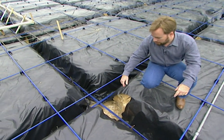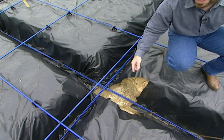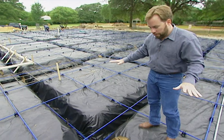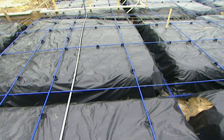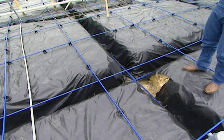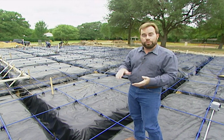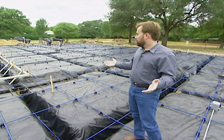You can see the big trenches and beams, and at the bottom you can actually see the top of a concrete pier. When we pour the complete foundation, the concrete goes down into these beams and sits on top of those piers — these beams form what's known as a mat foundation. The purpose of a mat foundation is to spread the weight of the house over a large area, much like a snowshoe. If you walk in snow your feet sink; put on snowshoes and you stay on top. We're doing the exact same thing with the foundation.